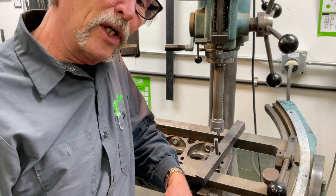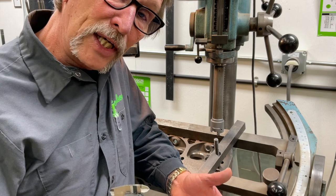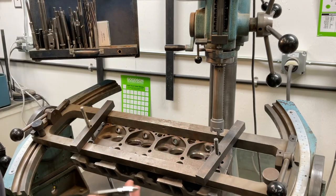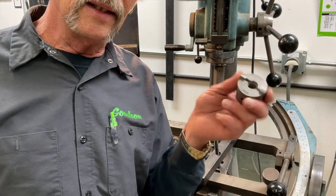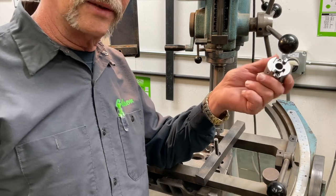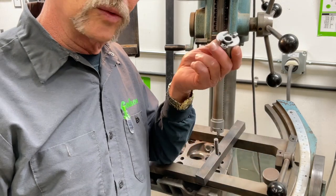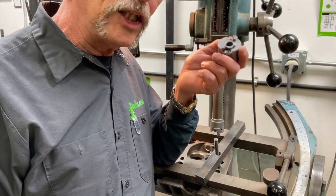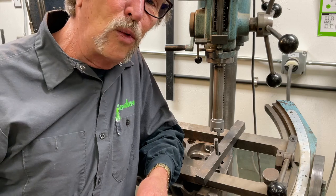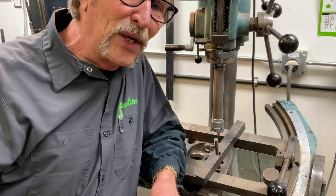The DWA 300 is a must-have tool in today's world because you've got metric sizes to deal with, diesel applications, and seats available in 10, 20, and 30 thousandths over for quite some time. There's nothing wrong with a fixed cutter as long as it happens to be the correct size — but adjustable counter bore cutters are the way to go with today's late-model aluminum and cast iron applications. This will get the job done accurately each and every time. If you have questions, give us a call at 1-800-533-8010 or visit us at goodson.com. Thanks for watching — we'll see you next time.